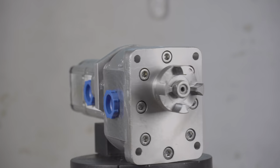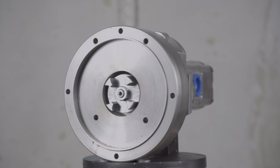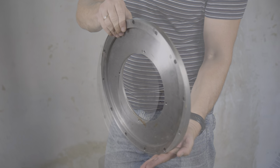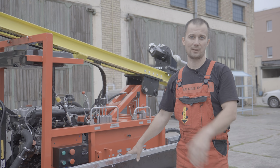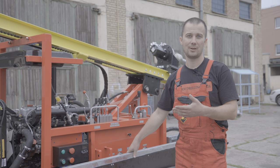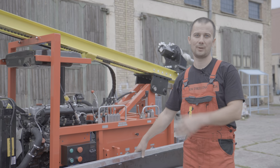The hydraulic system of the drilling rig uses a three-flow hydraulic pump. Three-flow because three flows of hydraulic oil are used by three consumers that are working at the same time. With an increase in the load on one of these working bodies, the rest do not lose their operating parameters, because they have their own autonomous power source.